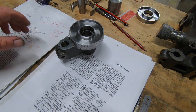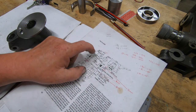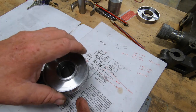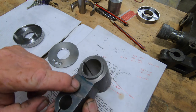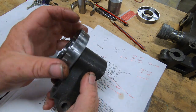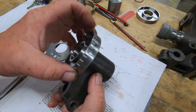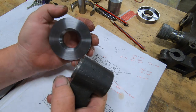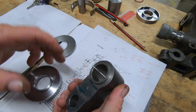And then make, swap pages here. Then I can make the collet, the nut. Once all that is fixtured to the casting, then I can obviously drill a hole through here, which has the plunger lock, because this has to have 12 holes drilled around here so you can lock this wheel. Once it's all fixtured on, when I drill through, I can actually pick up the radius it has to be, and there's no guesswork hoping I've drilled this correctly to the radius of this. Well, you know, get the alignment right, what I'm trying to say.